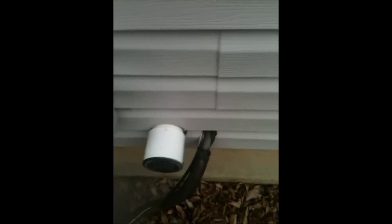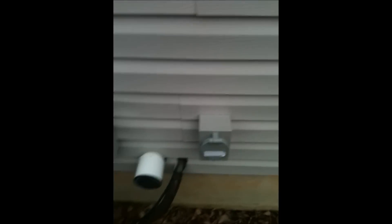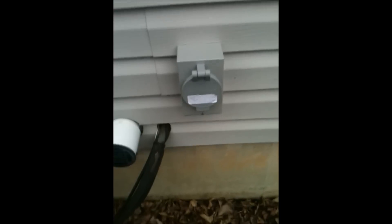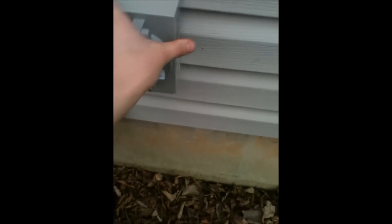All right, so we're outside now. I do apologize for the wind — it's a very windy day here in New York. That's the heater outlet coming out, and that's the air conditioner outlet right here. I was thinking of mounting the transfer switch inlet box right in level with the bottom of that. All right, we're out here and successfully we have hooked up the inlet box. The spare 10-3 wire — 10-3 is the wire you want to use. I got in an argument with the guy at Home Depot that was trying to tell me otherwise, that you're supposed to use 10-4. We actually pulled the DVD out of the container and watched the instructional video and it says 10-3 in the video. It's very sturdily mounted, not going anywhere. It is fully grounded and it looks good. Now we're going to start wiring the panel.